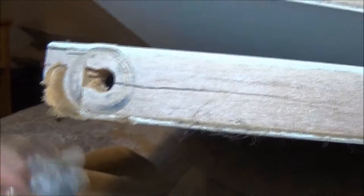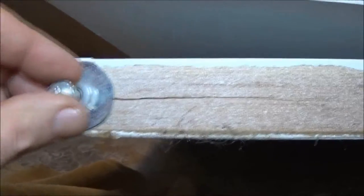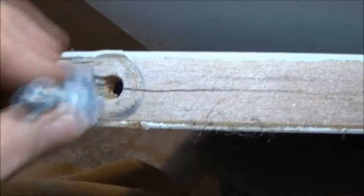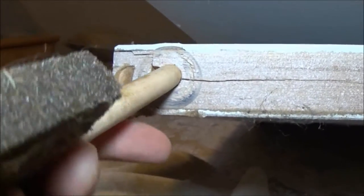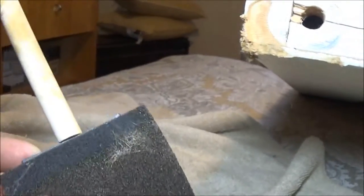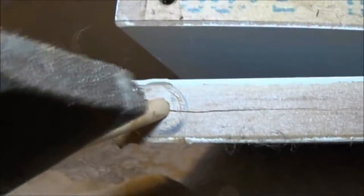So what we're going to have to do is try to tighten this up. Now, you can try to just glue that in there, but I don't know how well that would work. The right way is to get a dowel rod - a wooden dowel rod - glue it in there and re-drill it. Now, I don't have a wooden dowel rod, but I've got this little paintbrush that I have used. See if it's all real hard and brittle there. I didn't throw it away - I've got a couple of these - and I didn't throw it away for this reason.